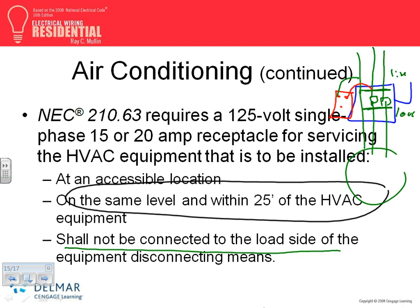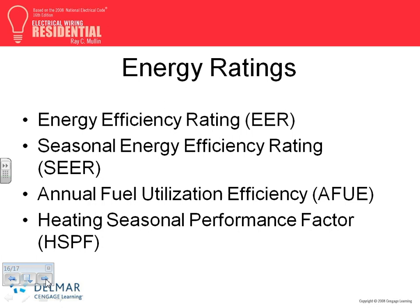No. Any questions, guys, about the HVAC equipment? The last thing, guys, about energy is the SEER. What is it, SEER 13 right now? These are, I believe now, SEER 13. The higher the SEER, the more efficient the HVAC equipment is. I think there's SEER 12, no longer used. I think there's 14. I keep forgetting. I know there's 13. So when they sell you an air conditioner, they say, what SEER do you want? SEER 13 or 14. The higher the SEER, the more efficient the equipment, and the more money you pay.